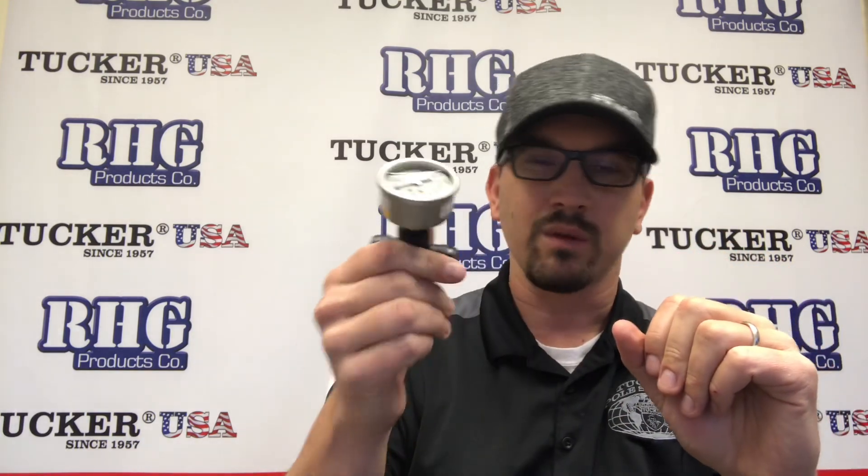You could also put one before your pre-filters and one after. If you put it before the pre-filters, it will tell you your incoming water pressure. After the pre-filters, it will read the water pressure after your pre-filtration. That's important — if you see a big pressure drop between the two, then you know your pre-filters need to be changed because they're clogged. If you swap that out and put a new one in, your gauge inline there should read close to what the first one does. So if you've got 50 psi coming in and good flow through your pre-filters, you should be right about 50 psi coming out of the pre-filters. But most systems are only going to need one of these, and it will help you with just about anything you run into.